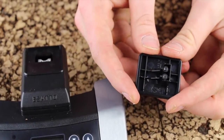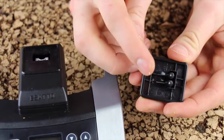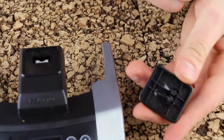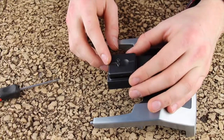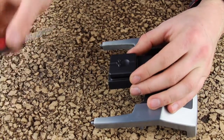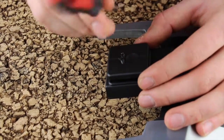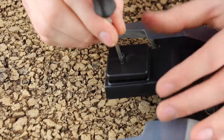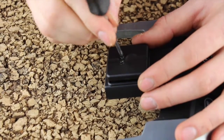We're going to install the weight platform onto the load cell. There are two black screws that secure the weight platform. Push them down so that the threads do not emerge — it's easier to get the screws started. This is a step where we need to be very careful not to apply too much pressure downwards. Rather than pushing down with your screwdriver to help the screw start, simply rotate it and let the threads catch and pull the screw down. Screws do not need to be very tight; they simply need to be threaded all the way down.